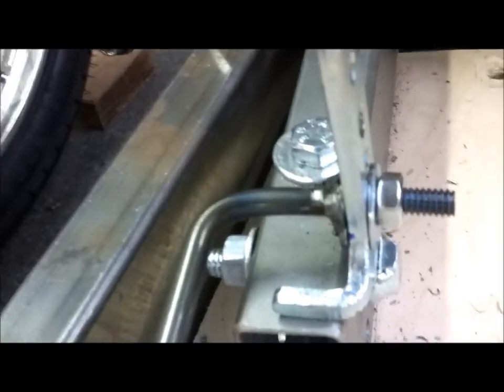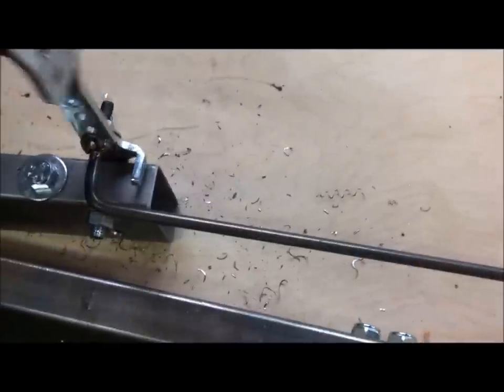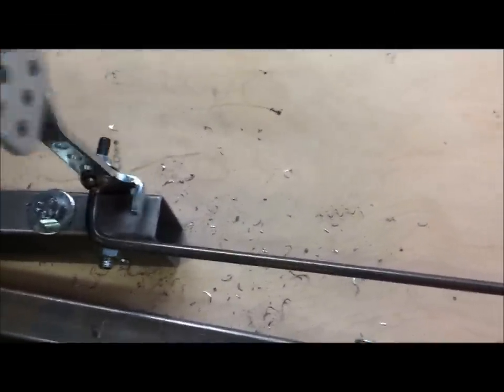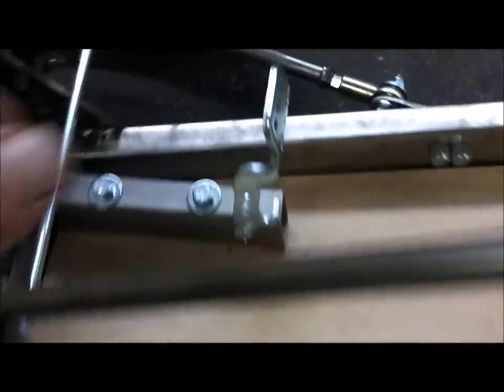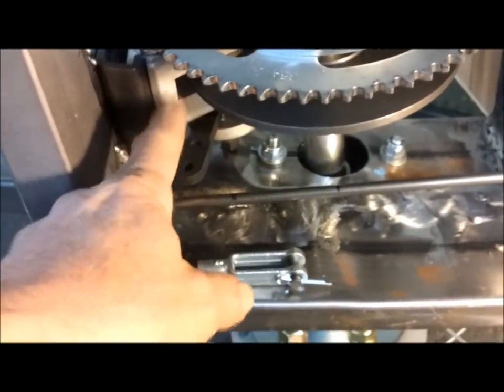I got the nut and the washer on there, so that setup looks good, and then it actuates just fine. You know, for the brake, about that much travel is all you need, because you can set it up to where the pedal barely moves. Unlike the throttle, where you need a lot of movement. A little bit more challenging this way, but I can figure it out. And I'll have to modify the seat, too, underneath so the rod can go under the seat. So it's always something.